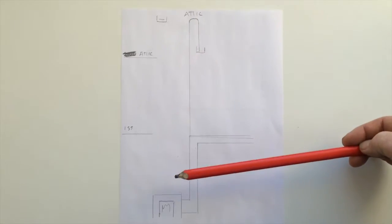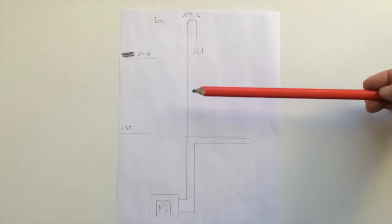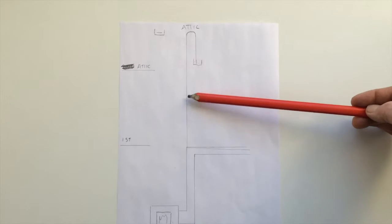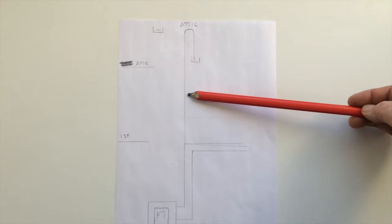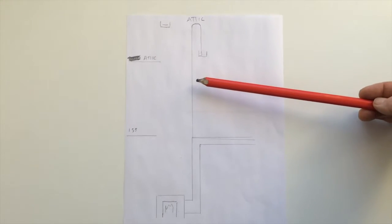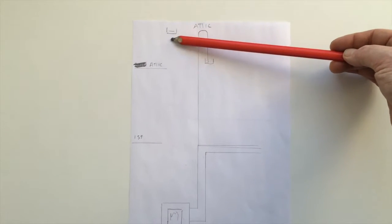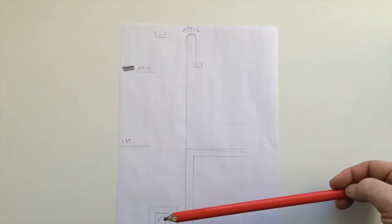This is the theory. Now, from the outset, I just have one issue with this. One place of concern for me is I may even go 1 inch on this pipe. I've already allowed 3/4. I may go 1 inch. That'd be 28 mil in European money. And I may go 15 mil or 1/2 inch on this. Well, I'll definitely go 15 mil or 1/2 inch on that one. The reason for that is simple.